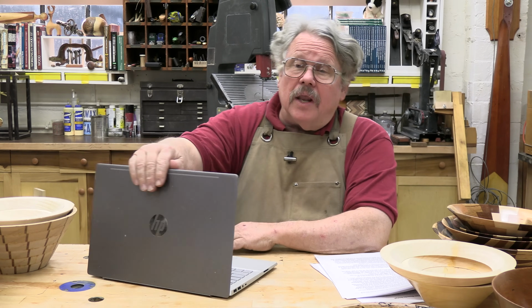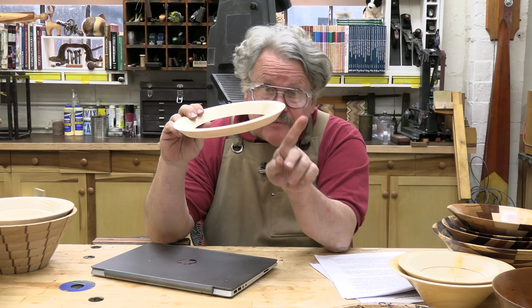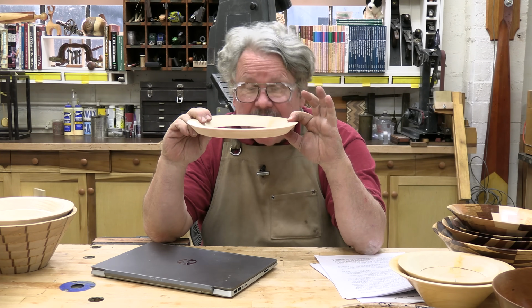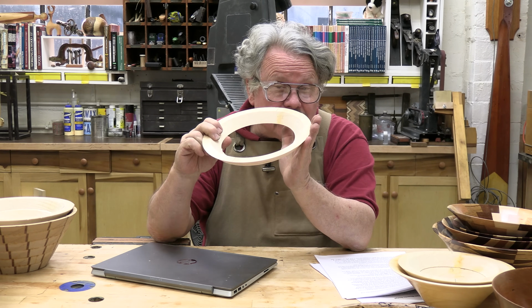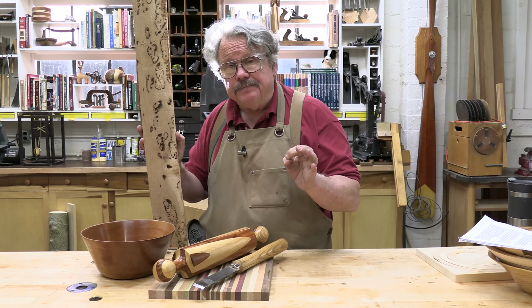If you don't feel like doing any figuring or using the calculator, here's a quick tip. At 45 degrees wall slope, the stock thickness is precisely the same as the ring spacing. So, use 45 degrees and you're good to go. Once you know your numbers, select the stock and plane it to thickness.